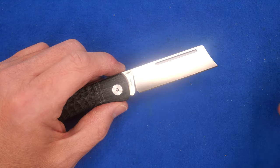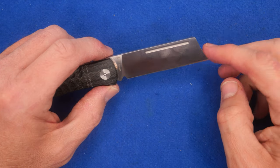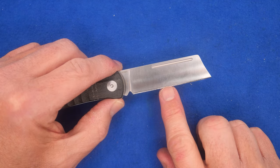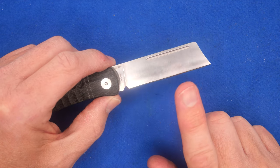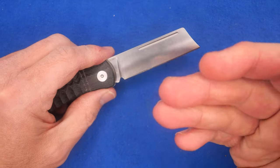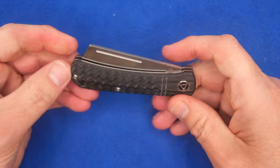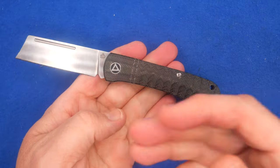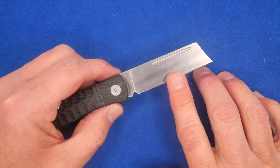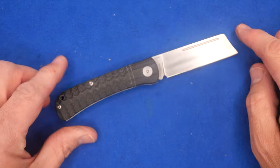I would have loved for my sample to be hollow grind — I prefer hollow grind because it means the edge is going to stay thin for many more sharpenings. This one is already almost up to the thickness I want it to stop at; it's not super thin, but it cuts quite well. The grind angles aren't great but it cuts pretty well. This was a prototype created to see how the design flows — they know what steel they're using and how a sharp knife cuts, so sharpening it perfectly wasn't really the point.